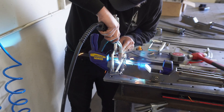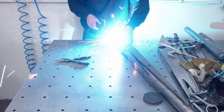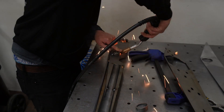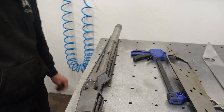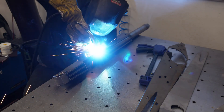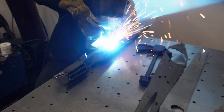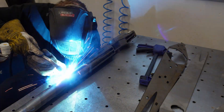We make sure that the outside of the uniball cup is even with the outside of the plate structure, followed by this quarter inch bottom plate that spans the length of most of the trailing arm. After that we've got these little pieces of tube that are cut — these are going to be your pocket where your shock bolt goes through. Now we're going to go ahead and weld up everything on here that's going to be covered up by the next set of plates, so we're welding the tube to all the plate work and welding in those little pockets for the shock mount bolts — all the nitty-gritty that's under there.